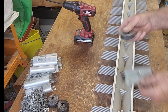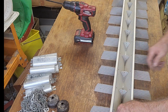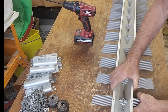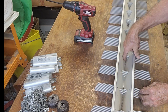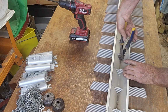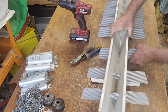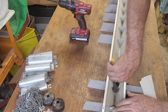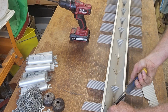Okay, so that bracket's definitely all steel. We have a little bit of chain hooked into these. But how do they come apart otherwise? I think if we flex that in, they'll just, oh, they've got little steel retainers. Okay, how do I grab these out? Yeah, little spring steel rods in here, and then they just fall out the bottom. So that's easy. We'll take these steel spring pieces out, and we will have to take the chain off it.